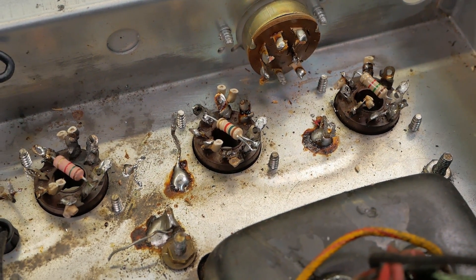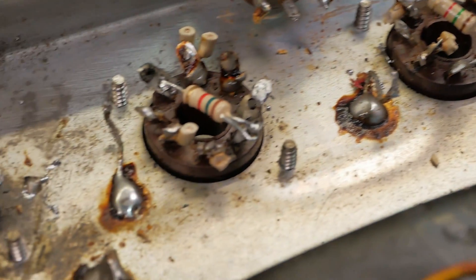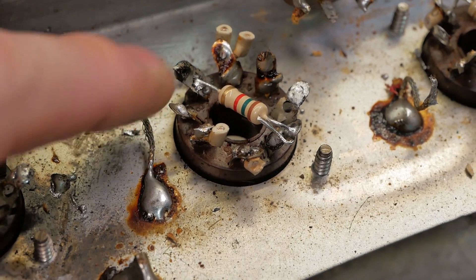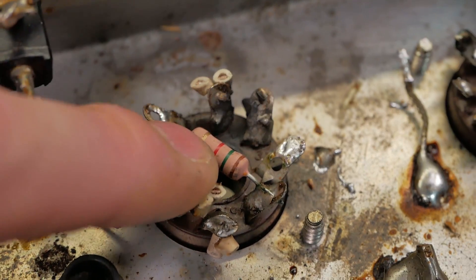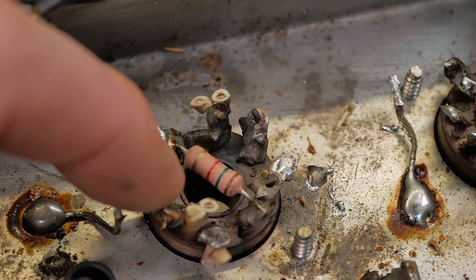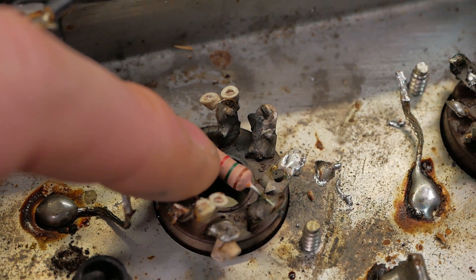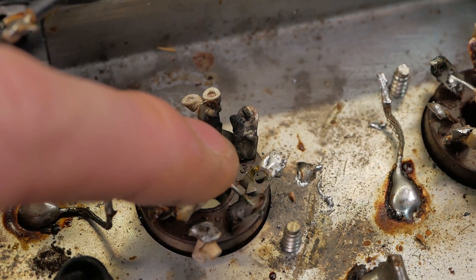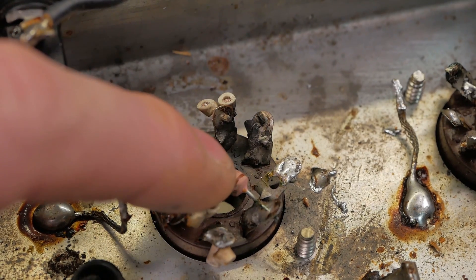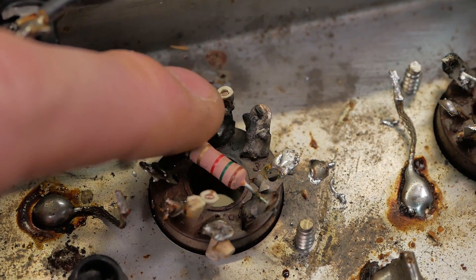I was debating keeping the sockets even though they're flimsy - the terminals are like foil, really thin, and all the wiring done to them was terrible. But then I spotted this blackened area here - that's a flyback event. That's been run without a load at some point. It always happens between pin 3 and pin 2 - the heater and the plate. Pin 3 with no load tries to hit infinity volts to maintain current; an inductive spike occurs and it reaches a point where it literally breaks over.